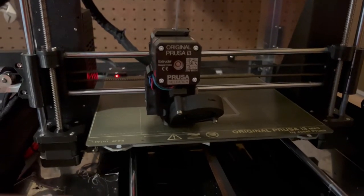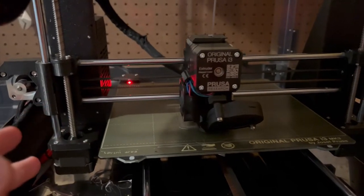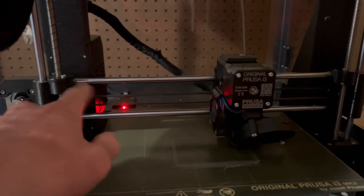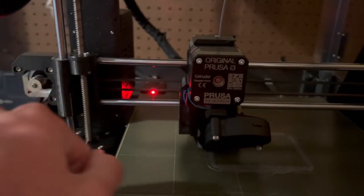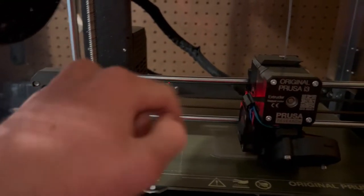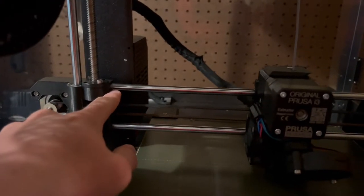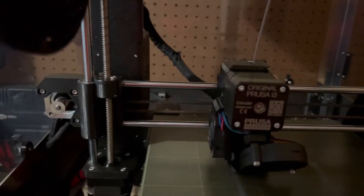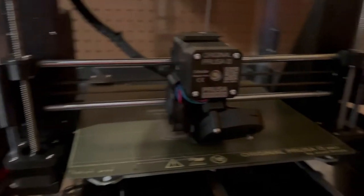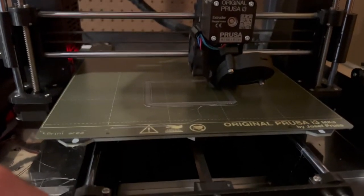So as you can hear, the motors are just a little bit louder than the Enders, but they have stepper motor drivers that have current sensing capabilities for the stepper motors, which means you don't need a physical limit switch. It just measures the current as it goes, and when the current peaks, it knows it hit the edge of something, and in the case when it's printing, it knows it hit something or is getting pulled or something, and it rehomes and it keeps going.